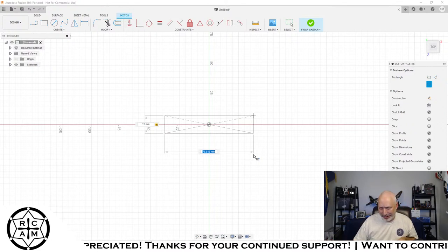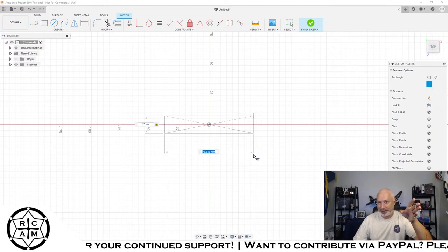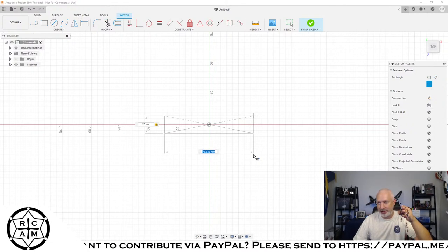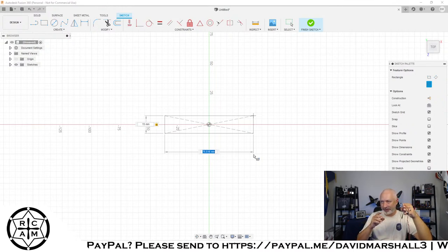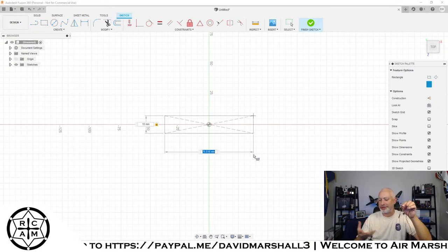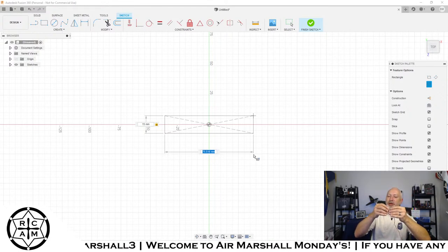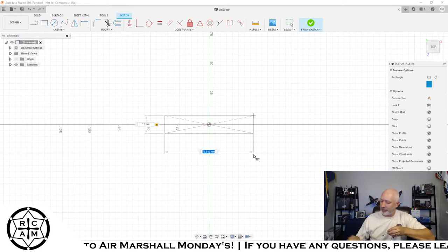I like to add about a half a millimeter. It doesn't need to be perfect. It does need to fit in there. I leave about a half a millimeter, and that gives me some space for the part to have at least some tolerances, because FDM printing is not like an exact science. So this will be able to move around a little bit and get a better seat once I have the mount built up.